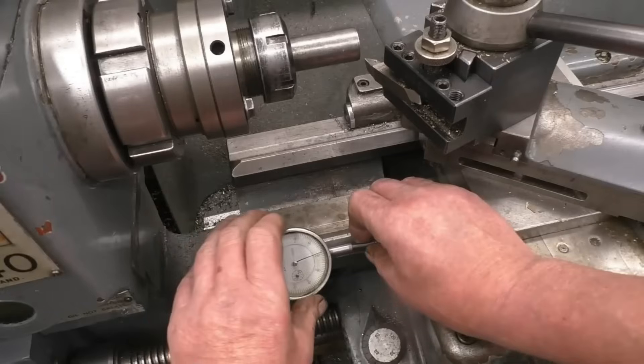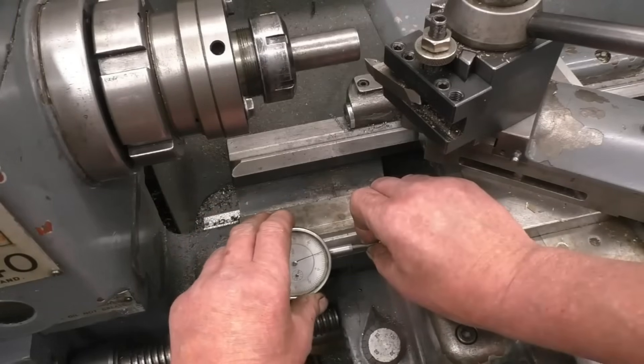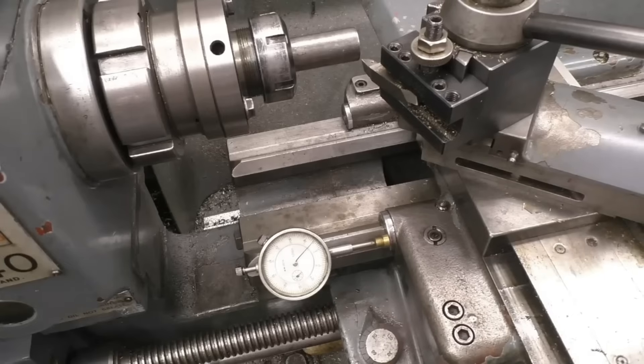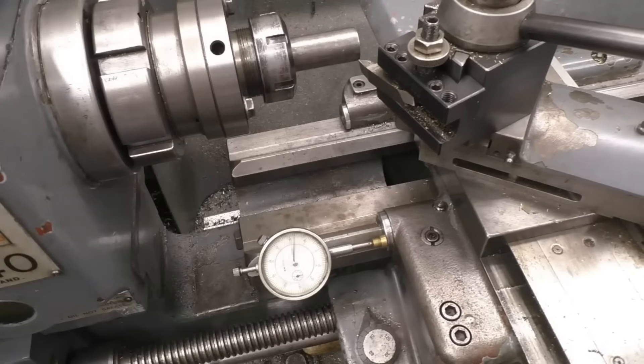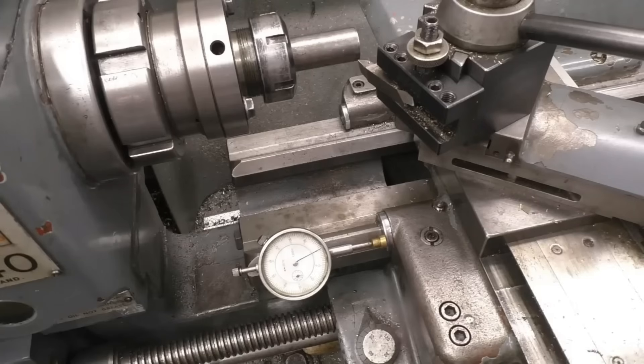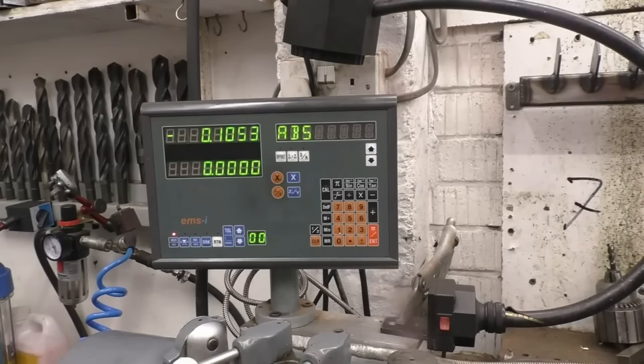It's just a magnetic indicator. You can set that to zero — this one happens to be imperial but you can get metric as well. So you set that to zero and wind in your carriage for whatever distance you want. Suppose we wanted 200 thou: we'll bring it in to five thou less than 200 and do your machining up to there, and then your final cut you bring it into zero and take your final cut. This lathe is also fitted with a DRO, so we can zero the DRO — that's in inches — and we could wind in to just short of the 200 thou, do your machining, and then your final cut will be in to the 200. You can also zero that and machine up to zero — when it's at zero you know you're there.